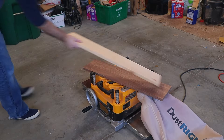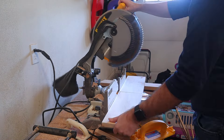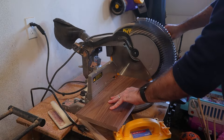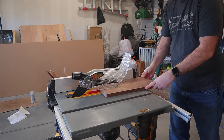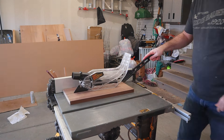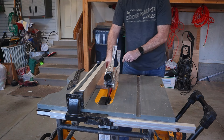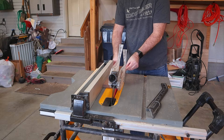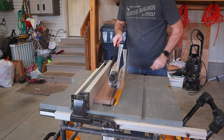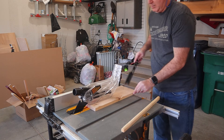I want the final length of this cutting board to be 15 inches, so I took the pieces back over to the miter saw and cut them to a rough length. The width of the board will be a total of 10 inches, composed of two 3-inch strips of walnut on the outside edges and a 4-inch strip of maple down the center. The built-in cheese slicer needs a groove down the width of the board that is at least 5¾ inches long. This allows the piece of wire to slice through that delicious piece of Colby Jack or whichever type of cheese you would prefer.